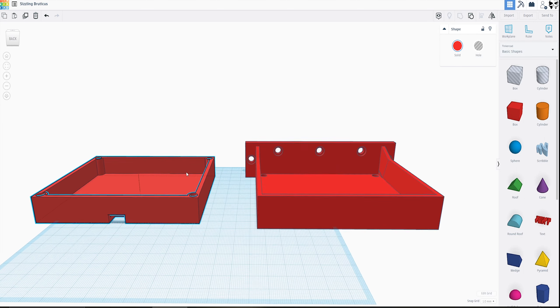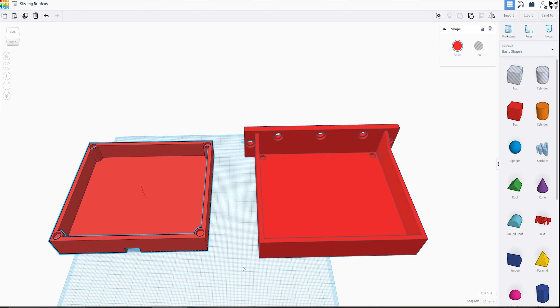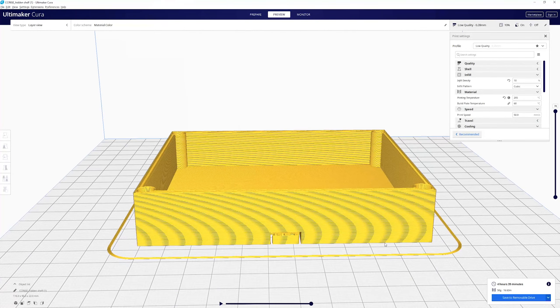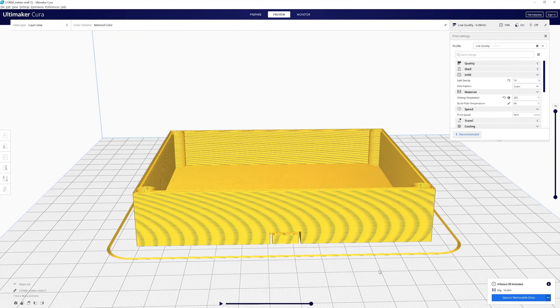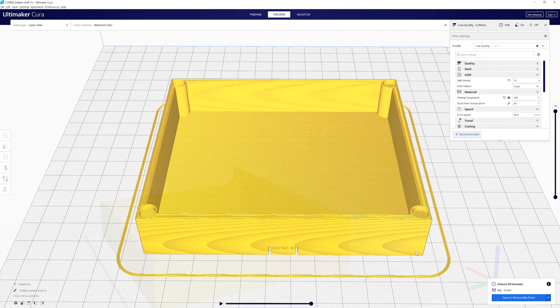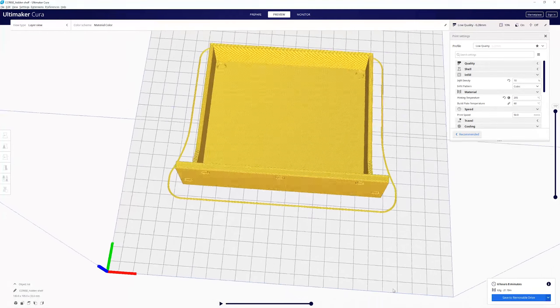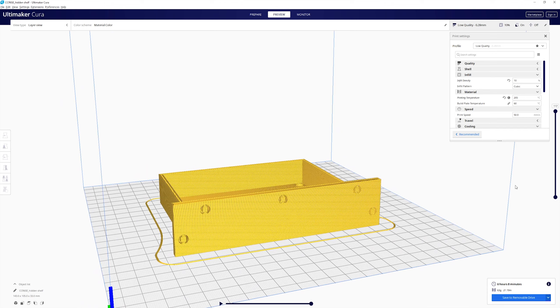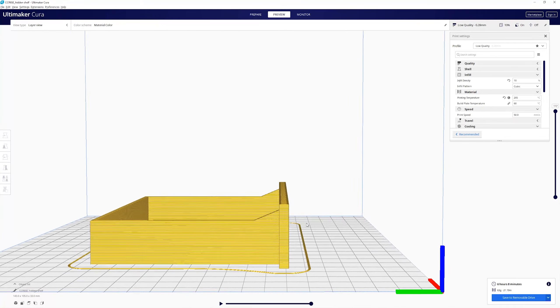We should be able to print them out as they are. Let's export them and jump over to Cura to see how they look in there, and then we'll go ahead and print them. Here we are in Cura — the settings for both are the same. We're on the low quality profile and I have 10% infill. Supports are on to protect the square on one and to protect the mounting holes on the other. Let's jump over to the camera and see how well they turned out, see if we can get the magnets in it and get it mounted, and hopefully it works out as it did in my head.